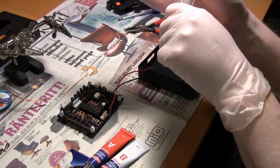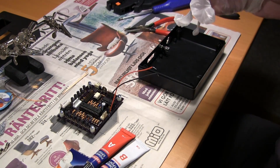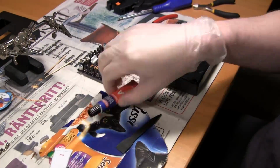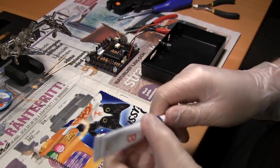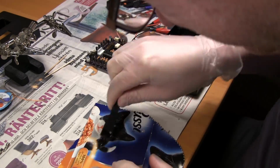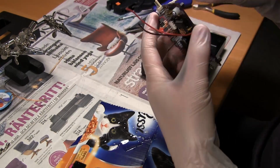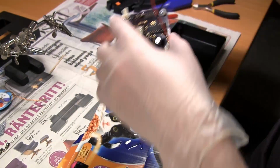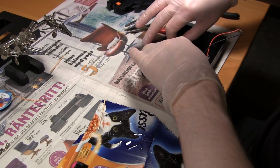Here I decided to glue metal standoffs to the base of the enclosure, so I had something to screw the board into. I mean, I needed to attach it somehow to the inside. I thought about using screws from the bottom up, but I'm not sure how much the screw heads would maybe scratch the table, because the little rubber feet weren't very big.